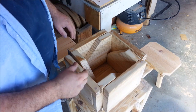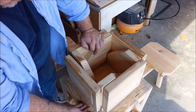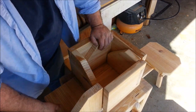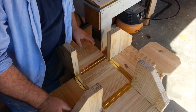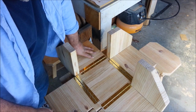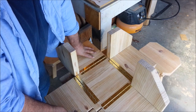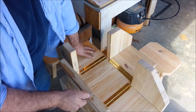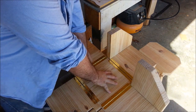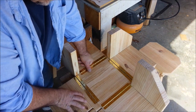What makes all these tables work is the unique way that the top folds up, and it's really quite simple. The centerpiece is evenly set back from the edge of the table all the way around, and then each table has four wings that fold out. The centerpiece here has a side piece that's hinged by a wooden hinge right here — I just cut this wooden hinge out on the bandsaw, then used my drill press to drill in a pin on both sides. Once that was done, I screwed the center top down, putting the screws behind the hinges so they would be hidden.